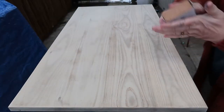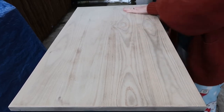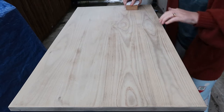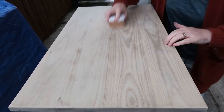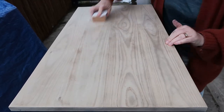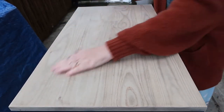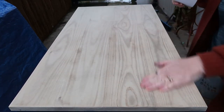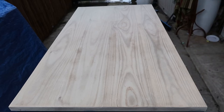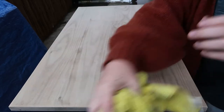I'm just going to give it a really quick smooth sand — this is a 240 grit. And you can feel the difference instantly, just doing that. It's all you're doing; it's not a big deal, not a lot more work. And after you've put the stain on, you can have a feel of it as well and see if it's raised at all. And if it has raised, then you can just sand it again — no biggie.